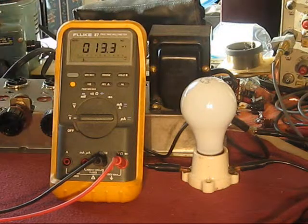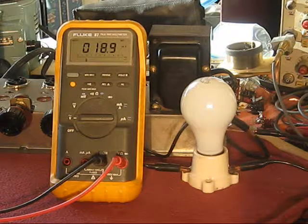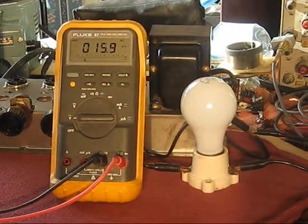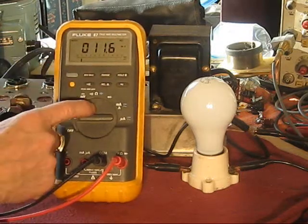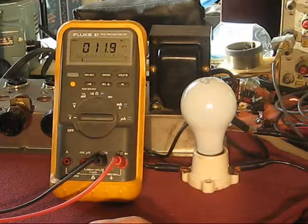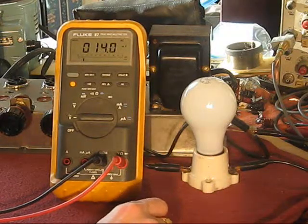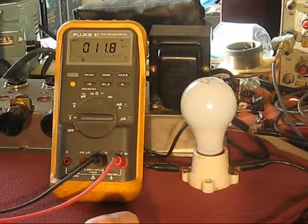Now, this isn't telling me anything about the frequency. That could be RF leaking through it, or God knows what. And every time the line voltage bounces a little bit, that is magnified by the step-up transformer that feeds this cap. So those slight excursions are going to show up here on this particular meter, on this particular setting, in this mode. But it's not volts. It's a few tens of millivolts of AC averaging, it looks like. So I'll go with that.